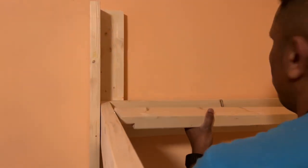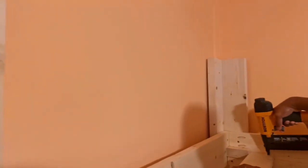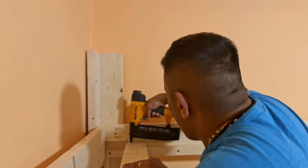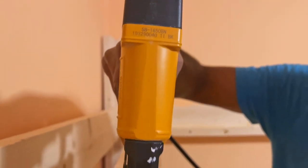I couldn't shoot the video of the bed frame and leg assembly. Here now I am putting all the slats — I'm just using some glue and nails to fix the slats on the bed frame. I'm using 2x2 scrap pieces for the slats.